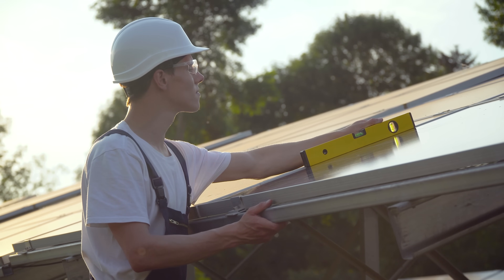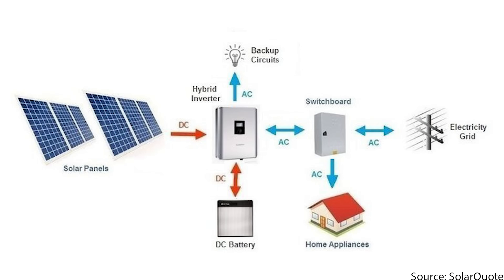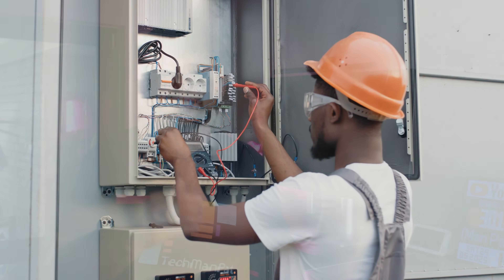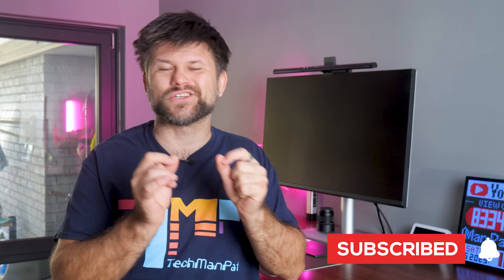If you have an existing solar system, an AC coupled battery with its own inverter is usually the simplest add-on. If you're installing a brand new solar and battery system, a DC coupled approach using a hybrid inverter might save you some conversion losses and possibly some cost. Either way, modern systems are pretty efficient — it's a few percentage points difference. A hybrid inverter is essentially the brains of a solar and battery system combined. They simplify the system with fewer boxes on the wall, and the intelligence they add is equally important. Hybrid inverters often come with software that lets you optimize your energy use — for example, you can program time-of-use settings, charge the battery from the grid during cheap off-peak hours, and then use the stored energy when rates are high.